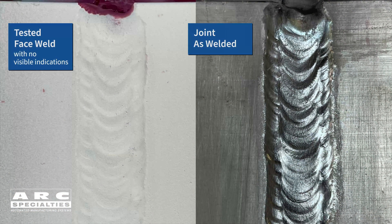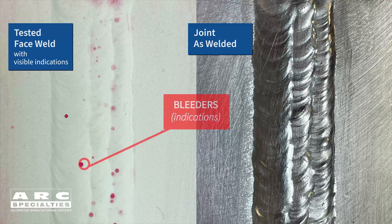So what we've shown you today is that with welding, sometimes beauty is only skin deep and you need to look a little closer to determine weld quality. Next week we're going to show you how to do visual weld inspection with simple gauges — you can measure fillet size and shape, and with cross sections you can check for root fusion and weld integrity.